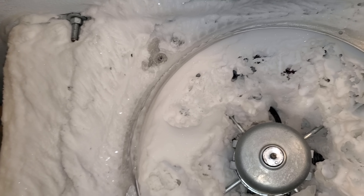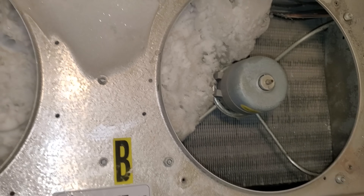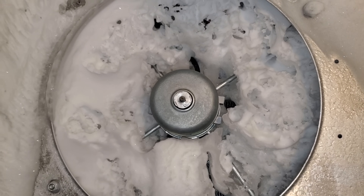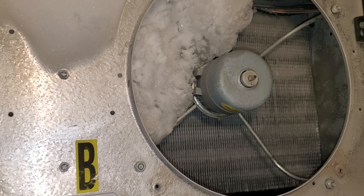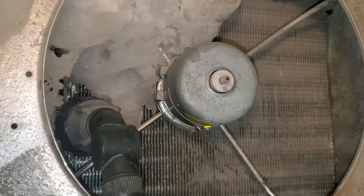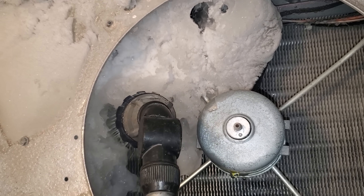Let's just keep going with this and see what happens. It's going to be almost impossible not to make a mess in here, and it's a walk-in freezer. We don't want to get water on the floor because it'll freeze and expand, but we can only do what we can do. I've got power turned off and we're going to go to town. Most walk-in freezer ECM motors have some sort of water resistance, but I still don't want to dunk them in water.